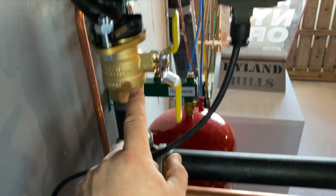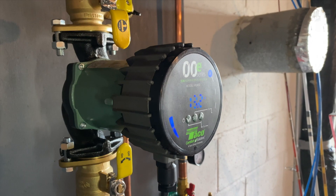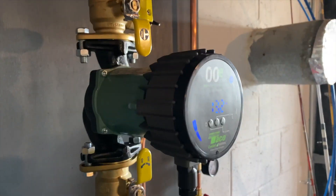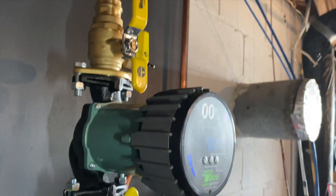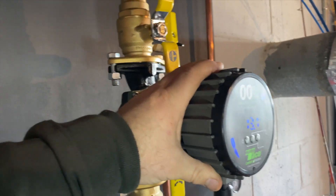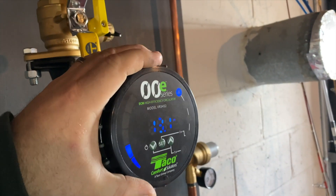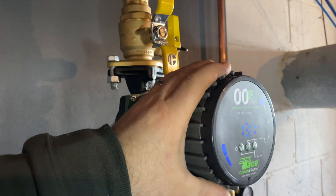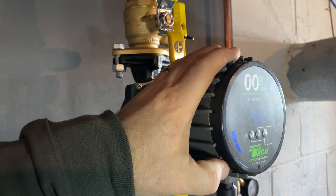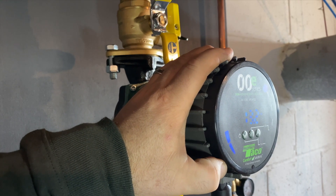On this tee is my pump and my supply to the indirect water heater, then we go right into the system pump — a Taco 00-E circulator. It's a discontinued model, replaced by the 00-34-E, but it's an amazing pump. It's on auto mode, constantly trying to balance itself out to the flow required in the system — a great fit here because we've got a lot going on with four different zones.